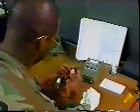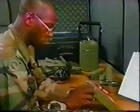Other than routine preventive maintenance checks and services to the radiac set's components, accessories, and case, the only specific operator and unit maintenance authorized are repair and replacement of the mylar window and replacement of the batteries. Flashing arrows on the display indicate a low battery condition. It tells the operator that about five hours of useful battery life remains and that they should be changed at the first opportunity.